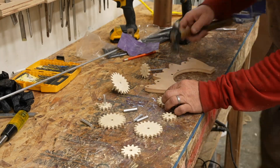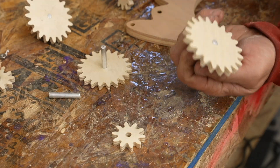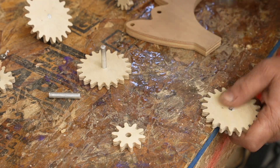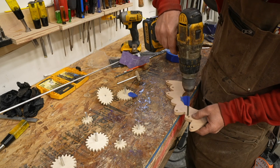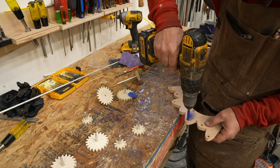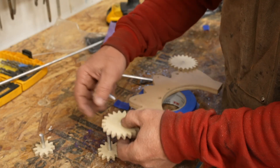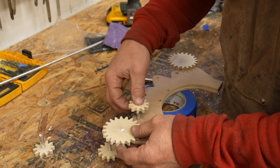I bought some quarter-inch aluminum round rods from Home Depot and cut them into little pieces. I needed them to move smoothly through the frame so they would just rotate. I ended up using a quarter-inch reamer to lightly ream out the holes to be slightly larger until they fit in really easily.